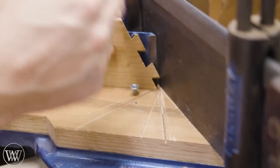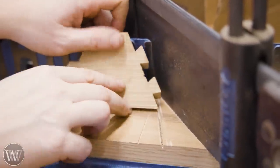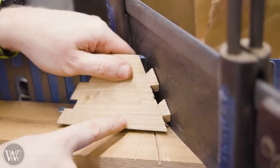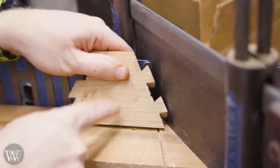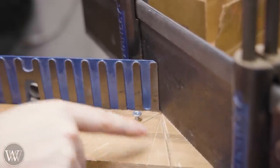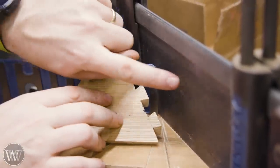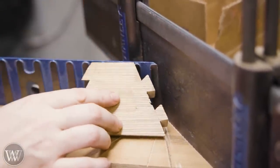This doesn't have a 10 on here, and also I'm not cutting them vertical, so I don't want it set at 10. I actually want to keep it set at five, but in doing so, there's only one splay angle that will work. The angle I had it on back here is not the right angle — I actually need to push it up to about 61.7 degrees. So if this splay is at 61.7 and I'm set at five, then it will give me exactly what I want. If I want the splay at any other angle, I have to change this to find that new angle, and that's a lot of math.